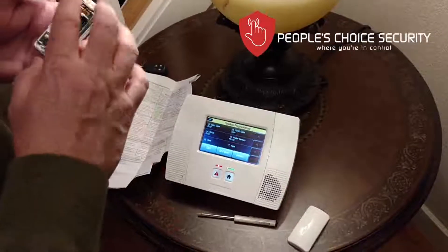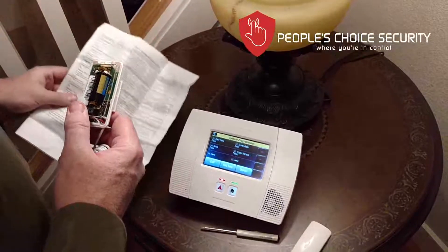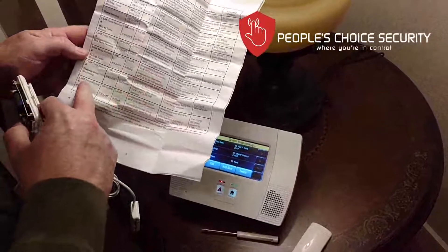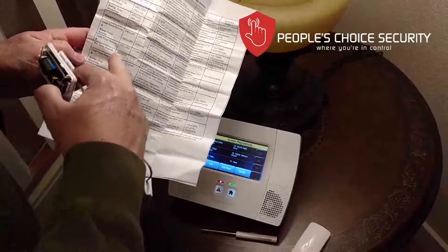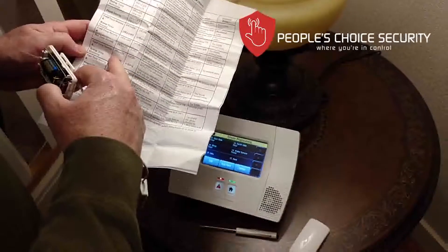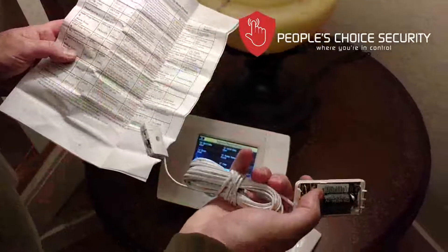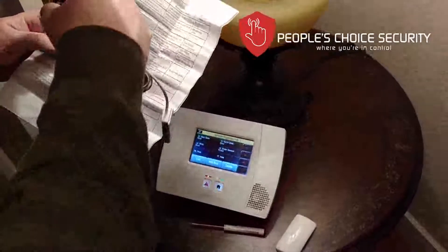You've now learned in this device for flood sensing. If you're using it for multiple purposes — like flood and cold temperature, or cold temp and freezer temp — just make sure you set the dip switch to the proper setting, use the correct probe, and ensure your loop number is set accordingly.